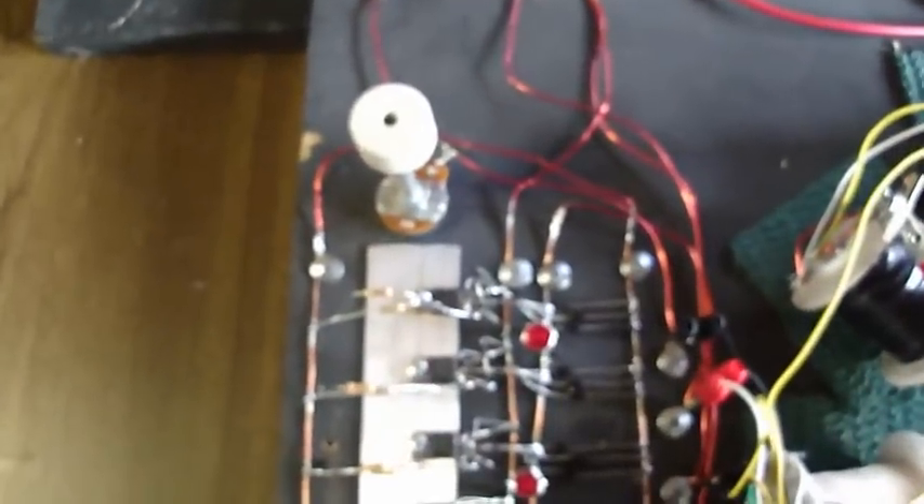I'm going to let this thing run a little bit. I just barely touched that and it jumped up to 1.7 amps. And if I try to lower it, it jumped down to 0.5, now it's down to 0.4, now it's back up to 0.5. I tried a rheostat on here but it was only 25 ohms, so there was little or no change whenever you turned the dial. So I need something other than these 5K pots — something that will make this thing act a little smoother instead of jumping around. And now it's clear down to 350 milliamps.